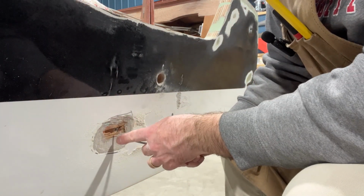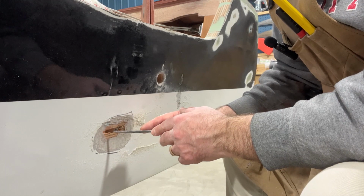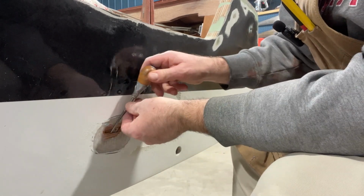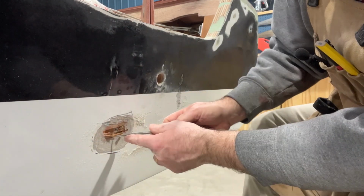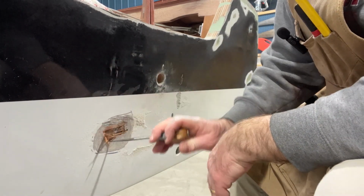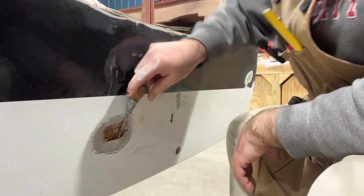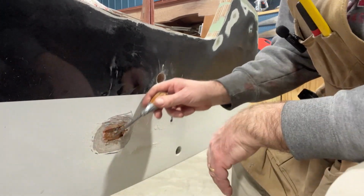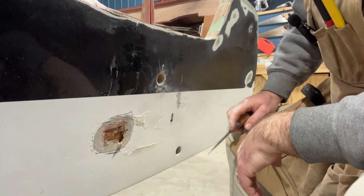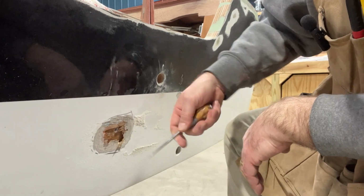This is some of the original wood that was left on the transom that I faired from the inside and then left. So this is the original non-marine plywood from 1957. You can see here's my glass layup right here, this piece. What has happened is that old wood, even though it looked like it was in great shape when I did the layup in 2002, it was not. This has delaminated to the point where the original transom, even though I left this glass on the outside, essentially I probably should have just taken it off in hindsight. This is probably the problem.